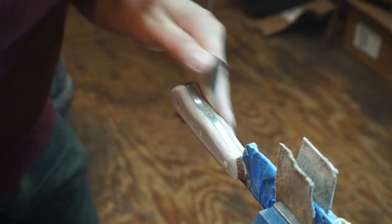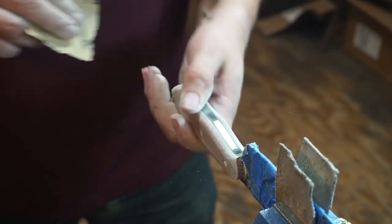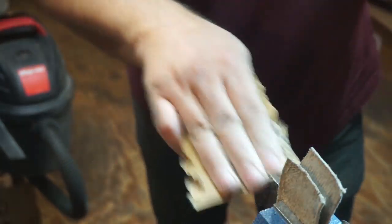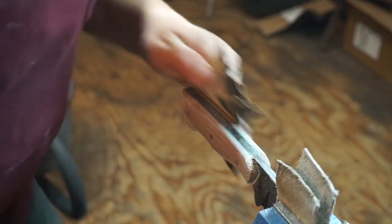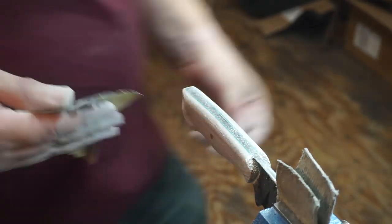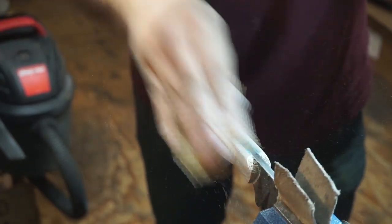Focus on going with the grain of the wood if you're doing wood. Make sure you're looking for lines and markings left from the 2x72 or whatever belt grinder you used — or even files and rasps — so you know where to sand. Also, when doing your handle scales, think about your pins: make sure you're sanding enough to get rid of scratches around the pins so that when you buff the handle they buff out nicely. You may need to sand in a couple of directions, then finish-sand in one direction to get smooth pins.